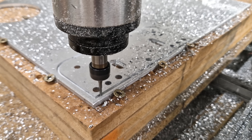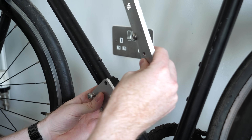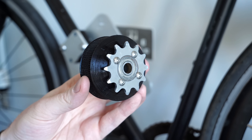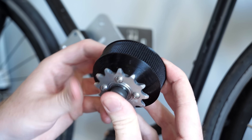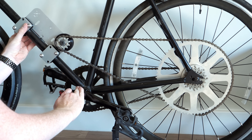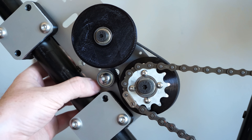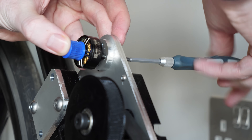The next step is to make the mounting plate for the motor and pulleys, which I cut from aluminium on my CNC router. This can then be clamped to the bike frame using a couple of 3D printed brackets, and we can then start mounting the components. Starting with the output pulley, which I've attached a sprocket to using a few bolts. This can then be attached to the main mount with a shoulder bolt, which is essentially a precision shaft bolt that the bearings will spin on. I can then fit the bike chain and tension it accordingly by sliding the mount along the frame. With the belt fitted, the centre pulley can then be attached in a very similar way and tensioned using a small idler bearing in the slot. And finally, we can mount the drone motor and see how well it turns.